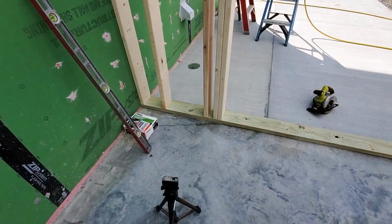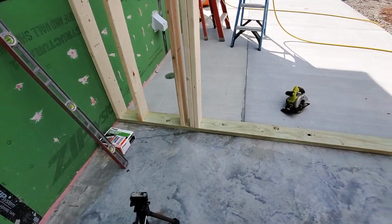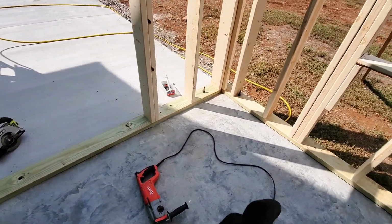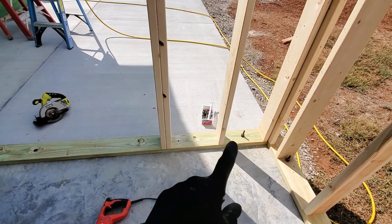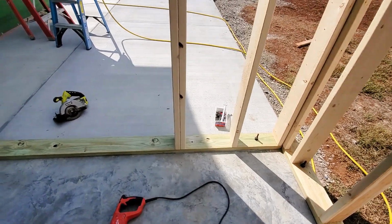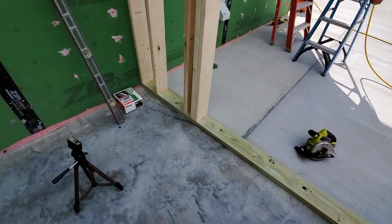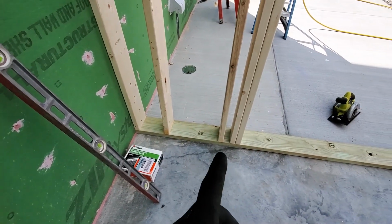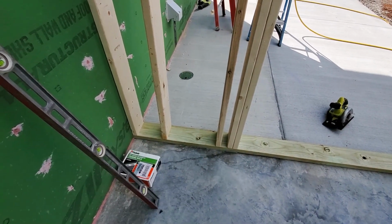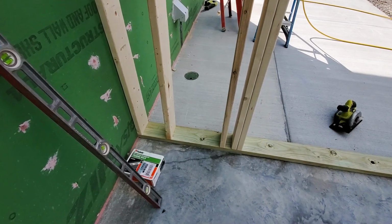Okay, I'm going to videotape this only because I could really screw something up. So I have to have 2 points between the openings so the wall doesn't twist. So I got my anchor bolt and then I put a tapcon right there. I did the same thing on the other side. We did not put an anchor bolt on this side because they didn't exactly know where to put it and I didn't feel like explaining it. I figured I'd put in tapcons later.